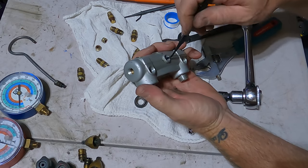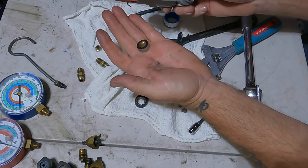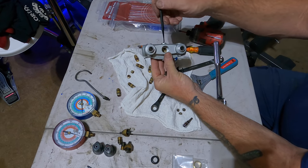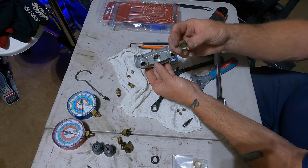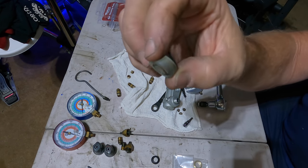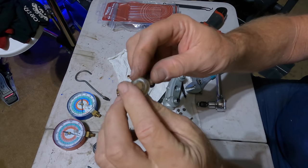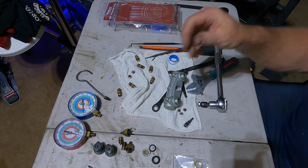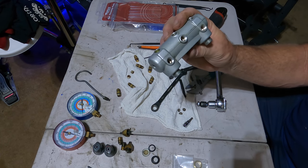There it is. I got it to poke enough — there it is right there. I got the pick in there and I was poking around to get it out. There's the old sight glass — she's good and dirty. It's not really scuzz from the inside where the refrigerant was. I probably could have got a Q-tip in there and just shined her up good. There she is — that is a completely stripped-down manifold that I want to clean up.